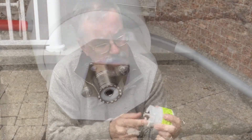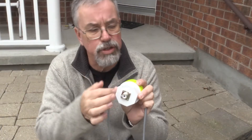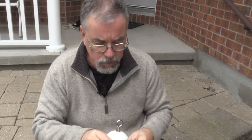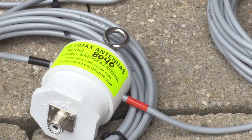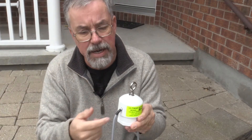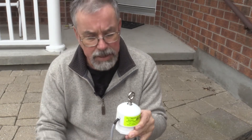There is some hint of sealant down below, so this is sealed down here. There are two small holes to let moisture out from underneath. One thing I found a little surprising is that there is no sealant around the coax. That might be okay in warmer climates, but here we've got ice in Canada. So I'm going to pop some silicone on there and around here, make sure everything's weather sealed. The problem in Canada is we get freezing rain that goes in there and freezes in, and those little holes are not going to let anything out.